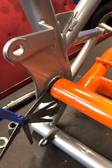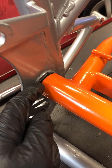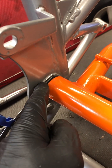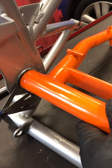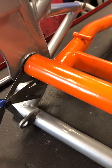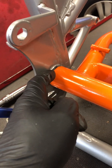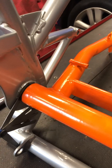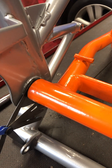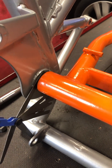The next part is to measure the gap between the edge of the swing arm and the frame itself. At the moment the swing arm floats backwards and forwards, which is intended — it shouldn't catch on the frame as it used to, which caused problems. Nylon washers are needed here. The gap is currently 4mm, and it will be re-checked once the bolt is tightened up.